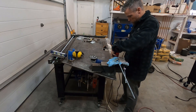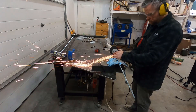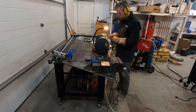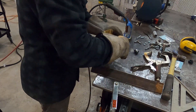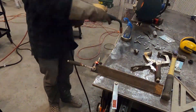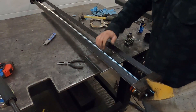I cut a bunch of stubs from 5/16ths threaded rod and cleaned up the cut ends on the bench grinder so a nut would thread back onto them. They'll be little 90-degree axles that will straddle the angle iron tracks. I ordered a bunch of skateboard bearings from Amazon to go on these axles. Here I'm clamping the rod studs to a scrap of angle iron to hold them at 90 degrees while I weld them. Here they're assembled and I'm welding nuts on the ends so they don't vibrate off. I'm cooling them right away to keep it from melting the plastic bearing shields.